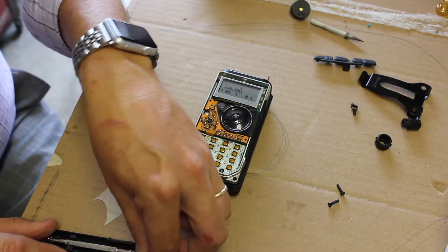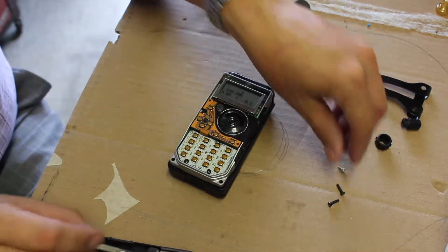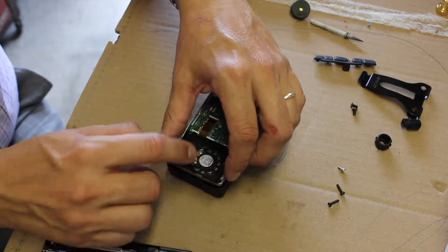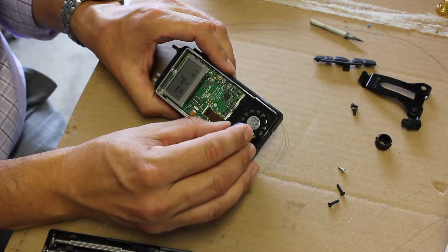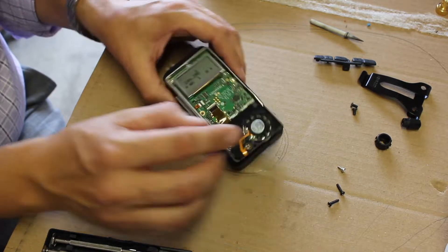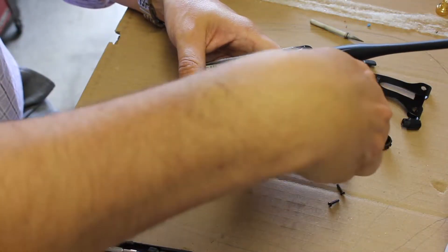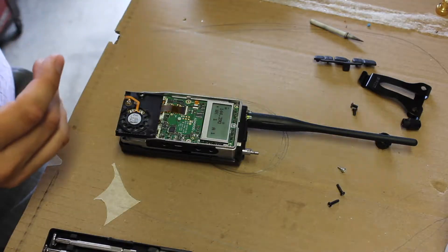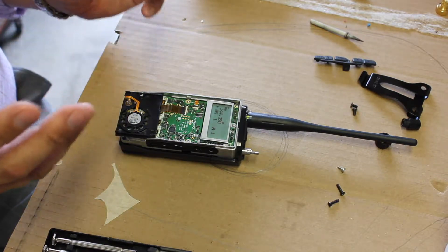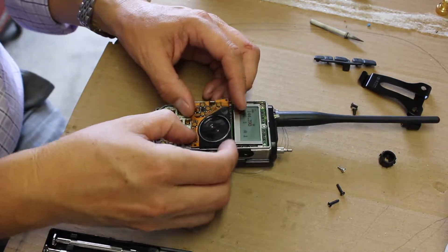So with this little Phillips screwdriver, take that out, flip this over, and there are the leads. What I did was take these two piezo leads and just replace them on those leads. I'm not going to hear anything because I don't have the antenna on — let's put the antenna back on. So I get some signal. That tells me it is a bad speaker; it's not the electronics inside. And I don't see anything that's really blown, so to me it's a replacement of this speaker, and they do sell it.